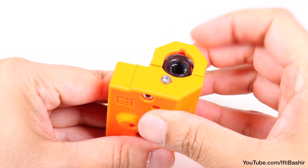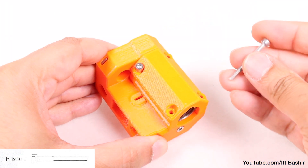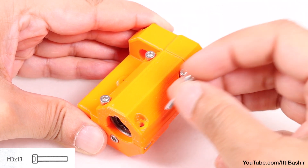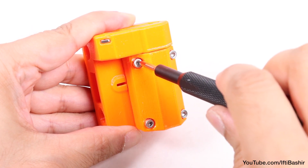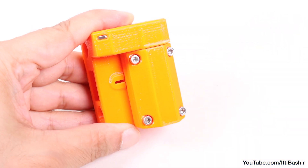The main difference here is with the screw lengths. Loosely install two M3x30 screws into the left side, and two M3x18 screws into the right side. Finally, tighten down in the typical diagonal pairing fashion, just so that they're nice and snug. Do not over-tighten, as you could end up snapping the 3D printed plastic part.